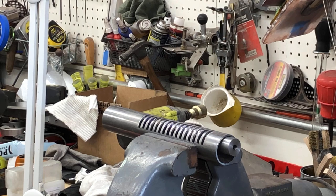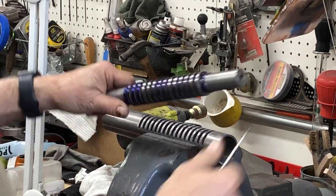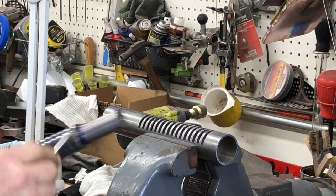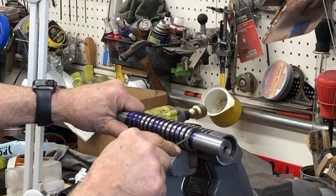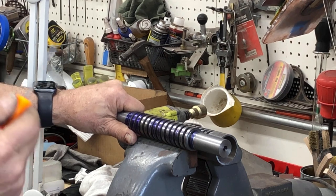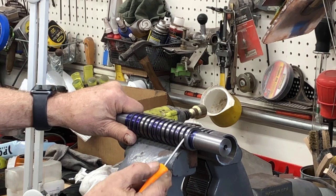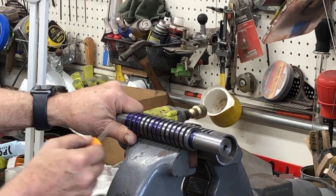And basically, just in case anybody gives a dang or wonders how to set it up, I just clamped this pipe. Both of these, I set them up in a mill, and I started with the first groove offset at 10 millimeters, and it's a 5 millimeter carbide end mill. So drill a groove, offset 10 millimeters, drill a groove, all the way down.